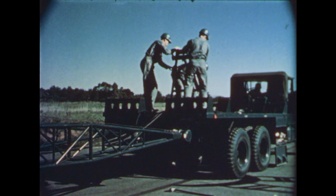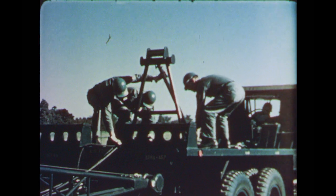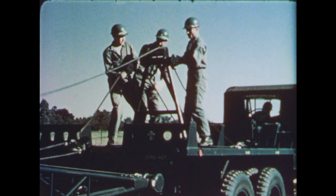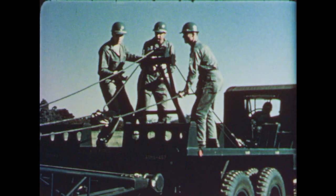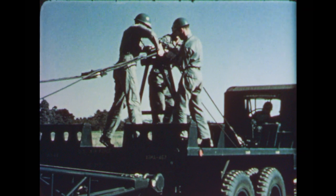An A and H-frame erector is raised for leverage during initial lifting of the A and H-frame. The top of the erector supports the anchor and winch cables. Also, the erector prevents cable fouling and possible damage to strands of the wire ropes.